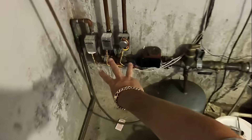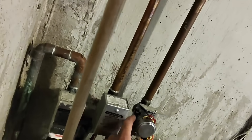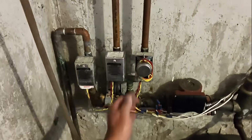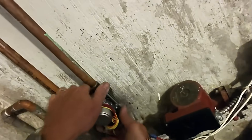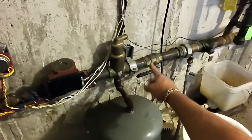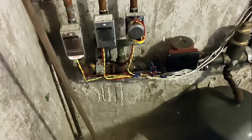We have three zone valves here. One of them has been leaking for a while and messed up the motor, and I can't unscrew it. So I got a drain down — I have a valve here I'm gonna pop open to get rid of all the pressure. I tried getting that one out, I got this one out but not that one. So I'm gonna drain down the boiler and all the piping here.